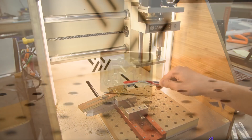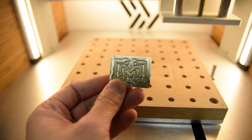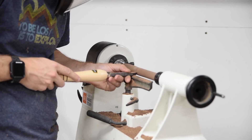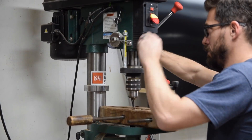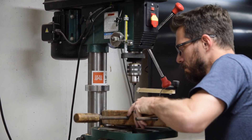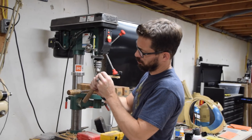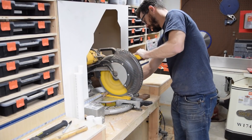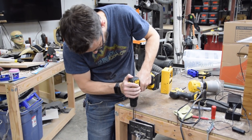Shortly before dinner, I pulled out a completed branding iron head. I couldn't leave without seeing it in action, so Bob threw together a really quick handle. This iron threads onto anything that's quarter-20, but Bob couldn't find any threaded rod, so he settled on a long bolt — cut the head off and turned a quick handle out of some walnut scraps. On the drill press, he drilled out a 13/64th inch hole and tried to run a wood tap through it straight on the drill press. I voiced my concerns, but the threads were destroyed as soon as the tap bottomed out. Luckily we had some extra length in the handle, so we chopped off the last two inches and re-drilled the hole. This time he tapped it with a cordless drill so we could back out the tap in a controlled manner.